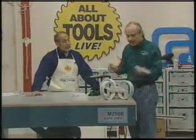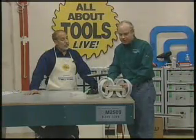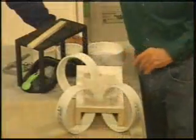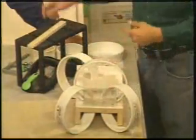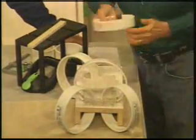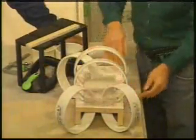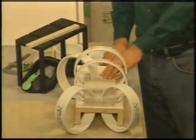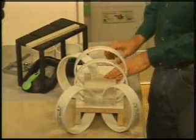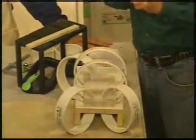Okay. Now, what happens is every other strip gets glued together. Now, these are all separate strips in here. And all you do is you take one of the cove clamps and you put it across this, a couple of clamps to hold it down to the rail. You've got to make sure that you wax your platform before you put them on. So you're gluing 2 together, then no glue, 2 together, and so on. And then 10 strips wide. Right. So then you end up with a strip final like this.